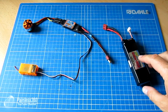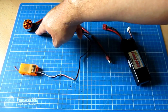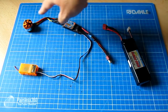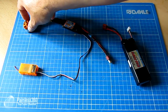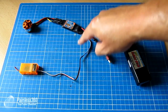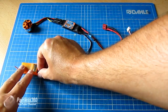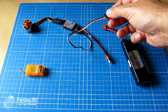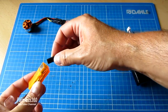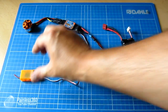For this bench test we're using a little 3S LiPo running an ESC that we're going to program. We need it connected to a motor because the beeps you hear from ESCs don't actually come from the ESC — they come from the motor itself, by sending a high-frequency pulse to the windings. We also have a receiver connected through the throttle channel. In something like a multicopter this wire connects into the controller, such as the APM or Naze, but when manually calibrating the ESC one of the best ways is to plug it directly into the throttle.